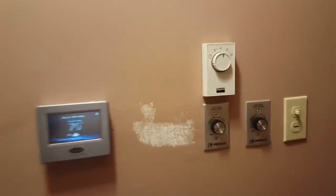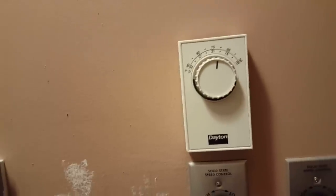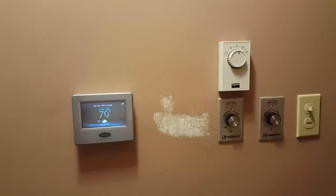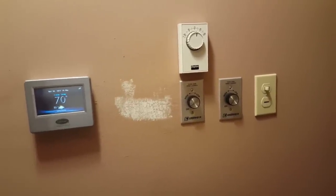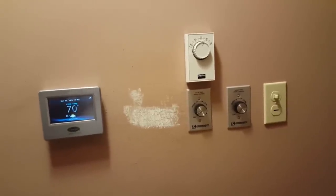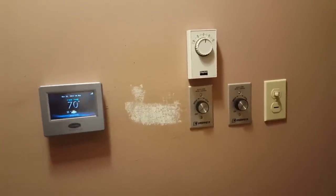Fan's on — good rush of air. I have two windows open: one in the bedroom, a big one in the living room. We'll just watch this until it shuts off. Right now let's just say it's set at about 68 degrees — it's not going to shut off until about 66, and it won't come back on until about 70. And I know for modern whole house fans, most of them just come with timers. That won't do us any good — I don't like that. I want it to run as long as it can.